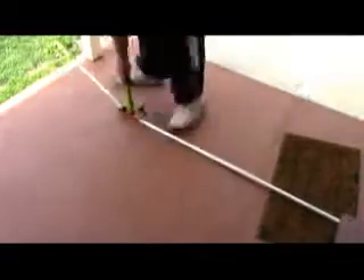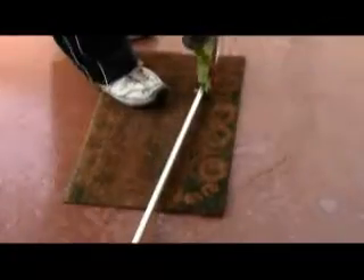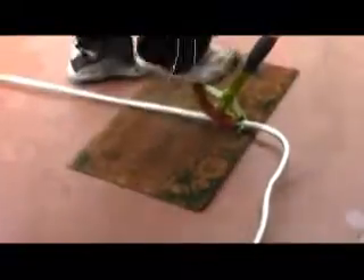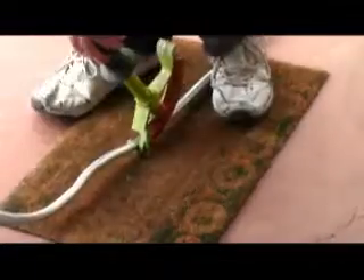54 to back bend. All conduit is run. It's not fastened yet, but that's our point of connection, our switch box. That goes over, and that's going to tee off to another light, then it terminates just on the other side here for whatever kind of Christmas lights or anything else they decide.